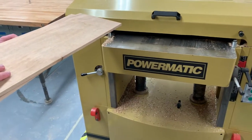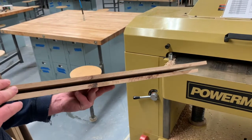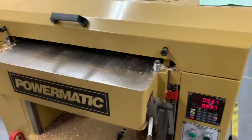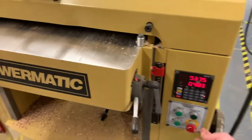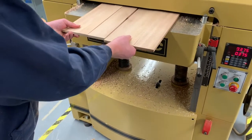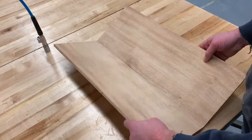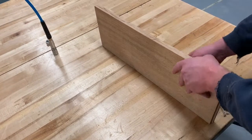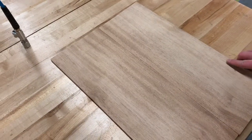The outside faces are already flat from before, so we just need to clean up the inside faces on the planer. These boards are a little less than a half inch thick, and we want to just make them nice and flat — leave them as thick as possible. I'm going to set this to three-eighths of an inch. After getting the inside faces flat, open this up like a book and decide which way you can open it to get the grain mirror image you like the best.